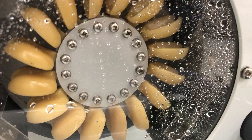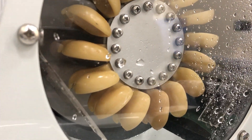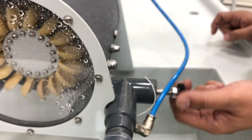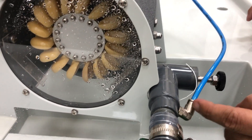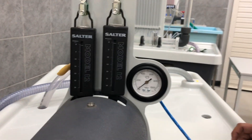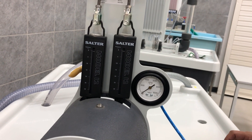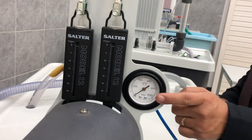The spear valve can control the water inlet from 100%, 50%, or 25% opening. We also have a pressure gauge here where we can measure the water pressure at the inlet, before it hits the turbine. The pressure gauge reads in millibar.